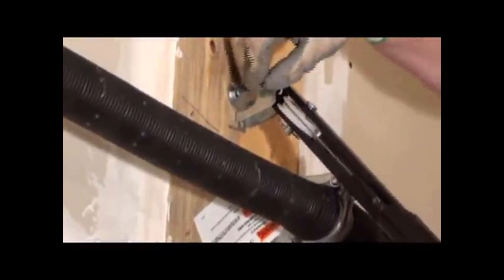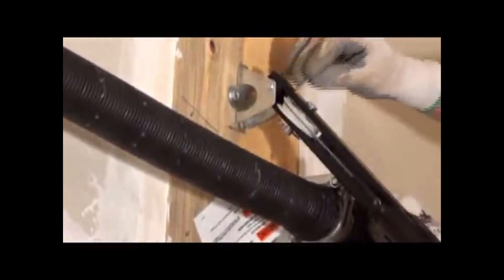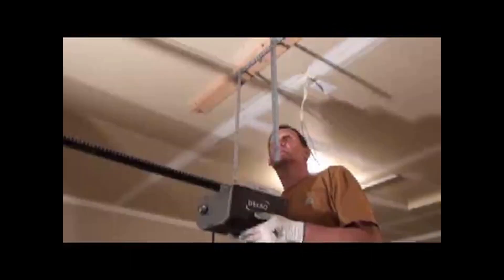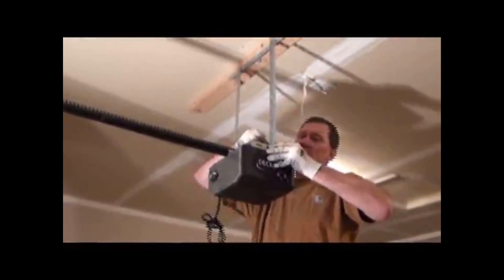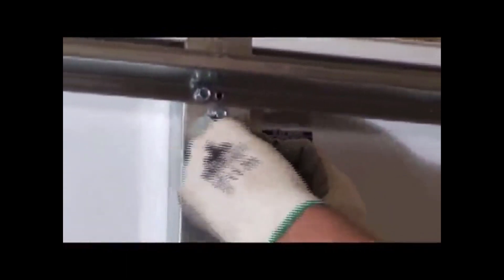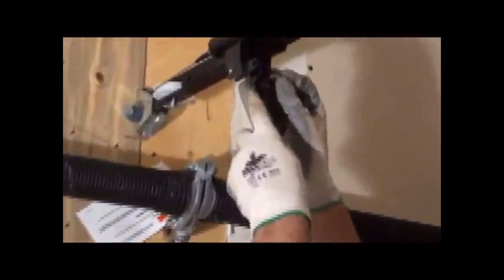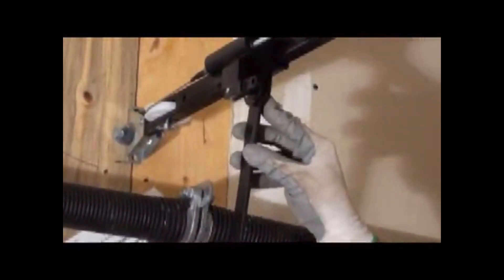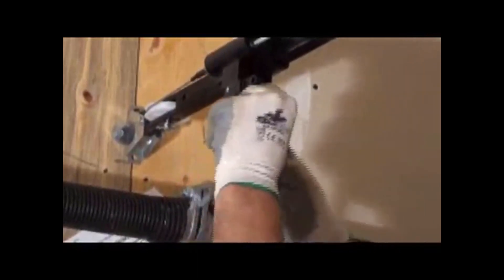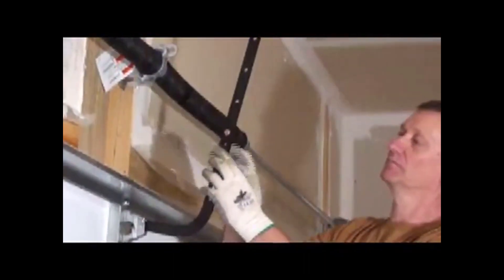Pre-drill the holes — you should have a solid board; you can't put that into sheetrock, for example. The holes in the brackets go up. Next, you take the assembled garage door unit and mount it through the hole using the pin and cotter key. You should set up the garage door opener so it's level, back to where the head is going to mount. Next, you mount the brackets to the door for the drive arms, top and bottom. Once they're connected to both pieces, that's how you adjust your length — slide the bolts in and tighten those up.